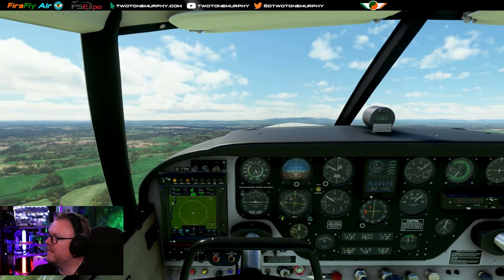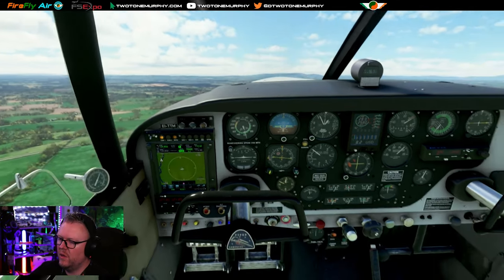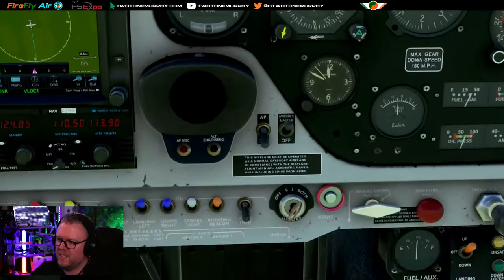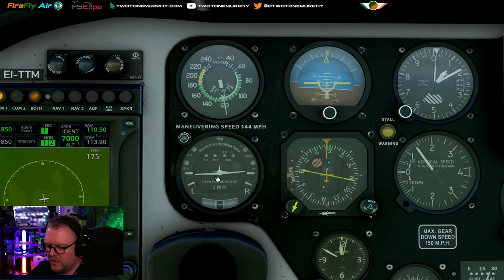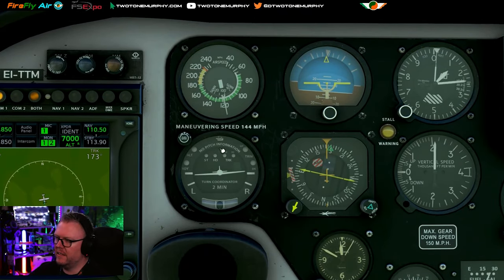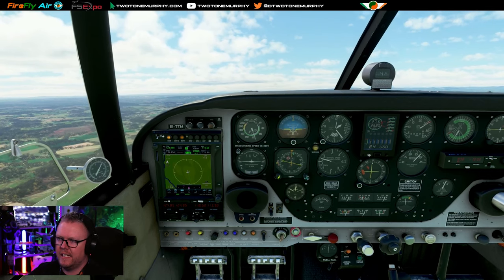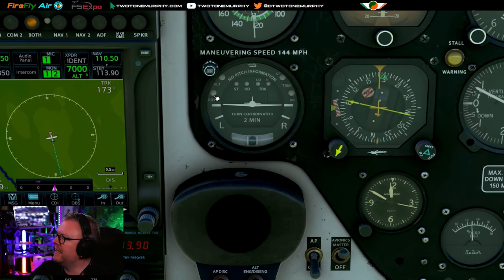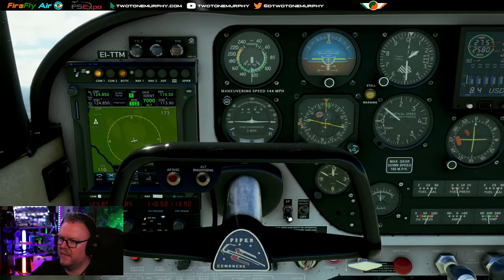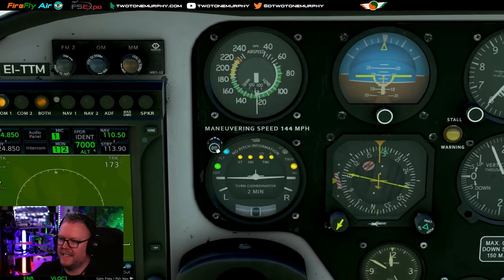The first thing you need to do is turn on the autopilot. You can do so by clicking on the autopilot master switch, which is located just above your mag switch beside the avionics unit. Once you turn on the autopilot it's going to go through its own self-test. It's not ready until the green light over RDY - or Ready - is illuminated. See this light here? We don't do anything until this is on. Autopilot on - and you can see all the modes that it has.